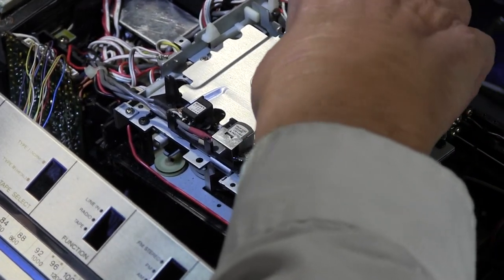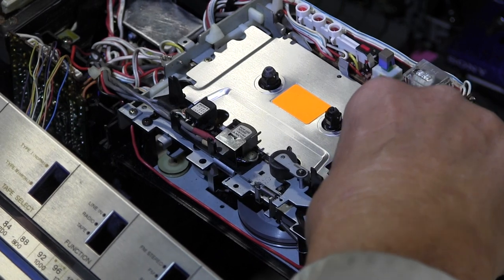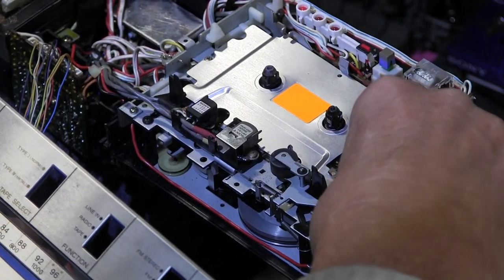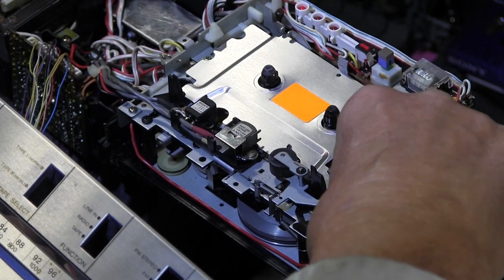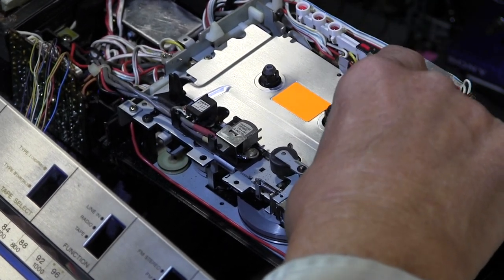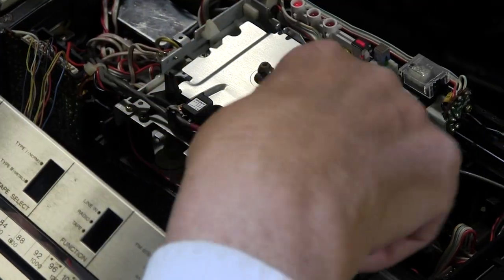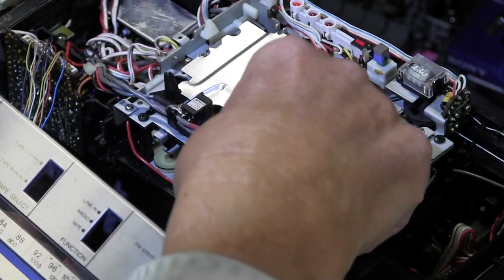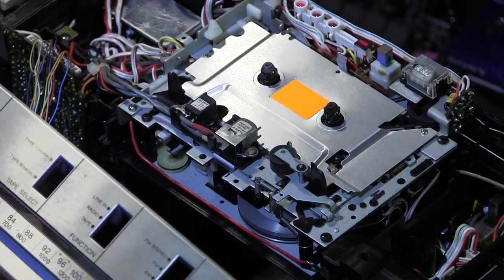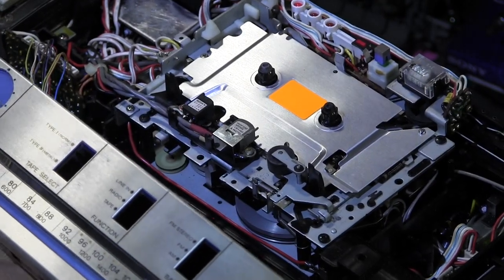As long as I'm rotating this, it's rotating the reel — and there's a little LED indicator under this belt. This has a proximity sensor of some kind: it's got a little LED and it reads the light pulses between this flywheel, which has intermittent openings and closings on this little flywheel thing that drives the tape counter. So as long as it sees that this reel is rotating, the motor will continue to run in play mode.